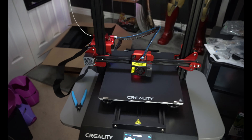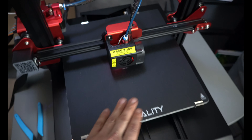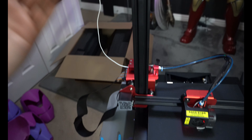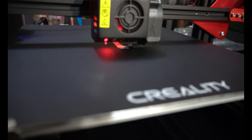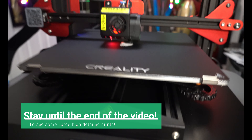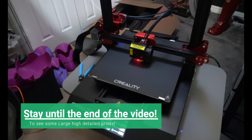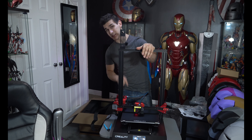Some tips: if you're having problems with the print sticking, make sure your bed is clean. Some isopropyl alcohol works great on these. These textured beds — don't use glue sticks on them. You don't need adhesives, just make sure it's clean. You can even use Dawn dish soap and water. The filament that typically comes with this stuff isn't usually the best. If you're having problems, invest in some better quality filament. I'm probably not going to let this finish. If you guys want a better updated review, I'm not putting this through a torture test right now — I just wanted to assemble it and see if it works. I'm never using that filament again, and we're about to test the filament runout sensor — it broke. Let's see if the print actually pauses and can resume.